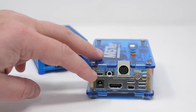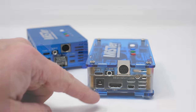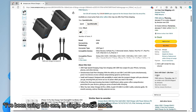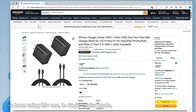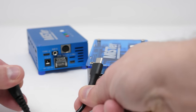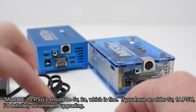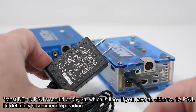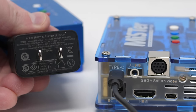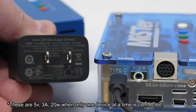An integrated power button is made possible by using a USB-C jack for power input. Don't use the barrel input for the DE10 — simply use a tablet-quality USB-C power brick, and that input will power both the I/O kit and the DE10. The kit comes with an adapter to use the power supply bundled with the DE10 through the USB-C port. The more accessories you connect to the USB ports, the more power is drawn, so a higher amperage PSU is preferred.